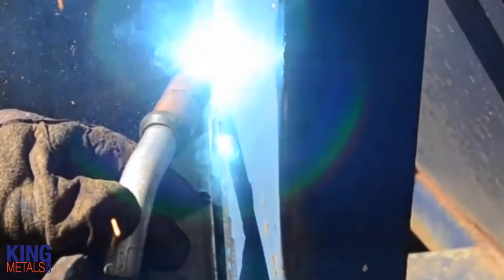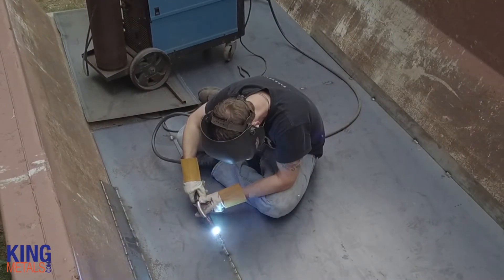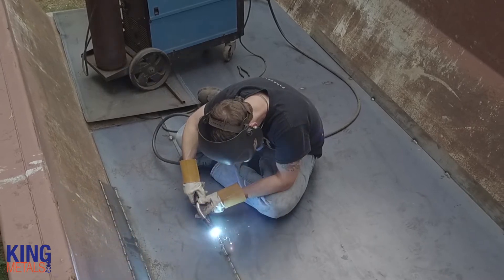Let's start with carbon dioxide, or CO2. It's the most common gas you're going to see most people welding with. One great reason is it's the cheapest of all the gases — it's perfect for most MIG welding situations. It's literally just plug and play: hook up a tank, turn it on, and start welding. You don't have to add any inert gas to it. There's very little downside, especially for a small shop. It can be a little messier though, with a lot more weld spatter to clean up if appearance is an issue. It's just not as consistent a process when doing a lot of welding compared to a mixed gas.